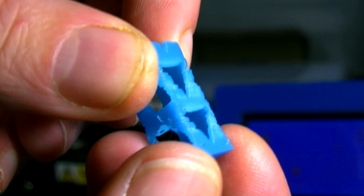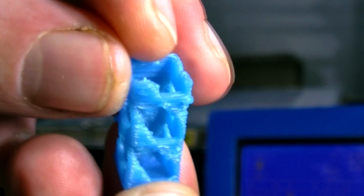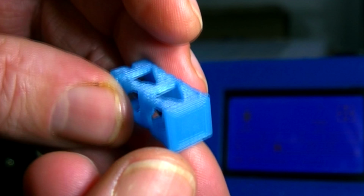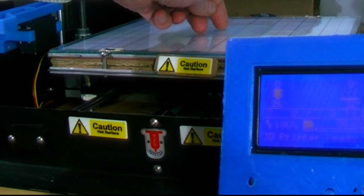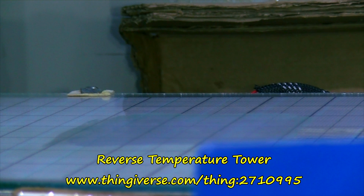There's a base. Elmer's glue stick on borosilicate glass here. Well, I don't know, to be honest. Skirt here. I do ask for skirts. Dodgy using your nails because it can get under the nails. It comes up all in one piece, so adhesion to the bed is pretty good, I think. I don't think it moved, to cause it to lift like that.